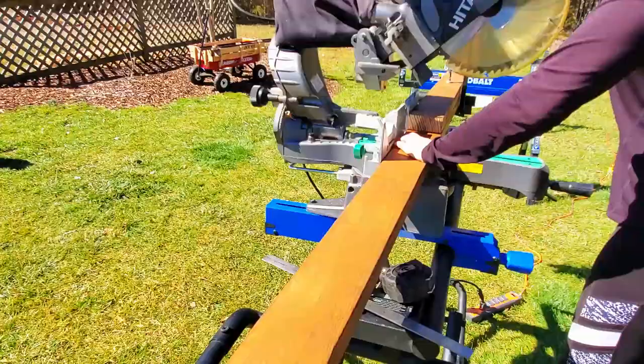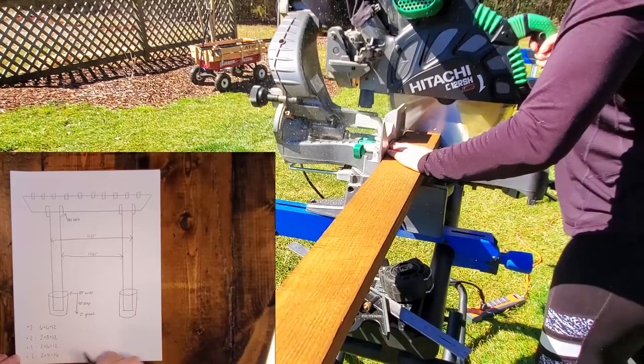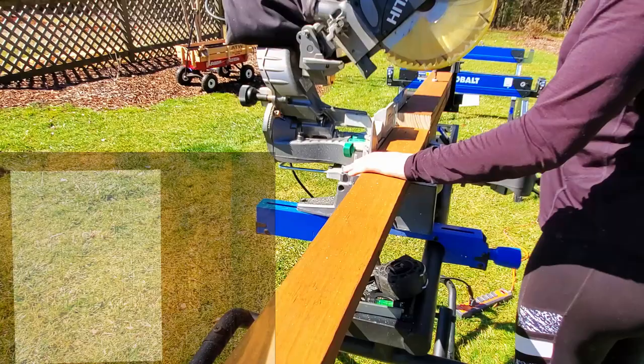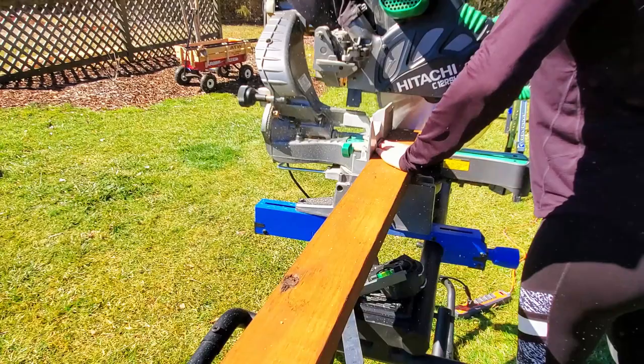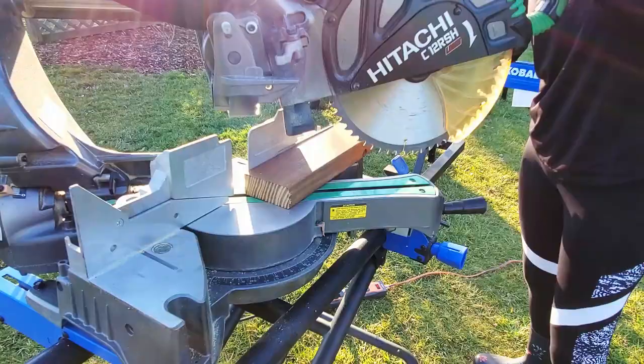Now it's time to start cutting and preparing all the wood pieces needed. Both 16-foot 2x4s were first stained and dried prior to cutting. To create the 10 rafters used on top of the structure to construct a mini pergola for my grapevines, both 16-foot 2x4s are cut evenly into 5 3-foot rafters each for a total of 10. I then set my miter saw at 45 degrees and cut an angle at each end of the rafters.